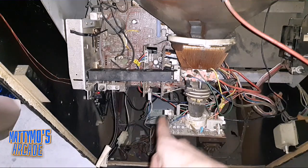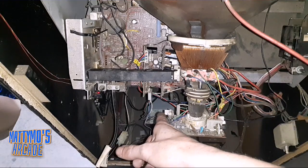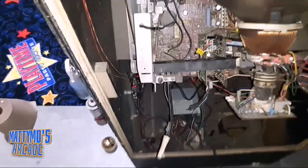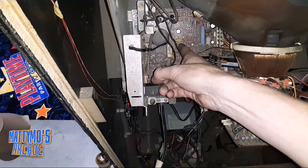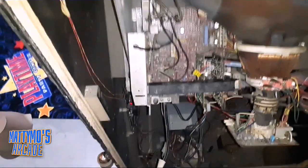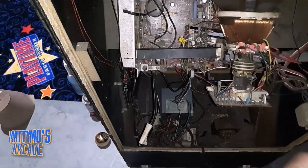And the color transistors are right here. And these are your color adjustment pots here. And then those two are your red and your blue drive. And the other thing is if you're trying to adjust the monitor, we have these little plugs right here. There's four little spots where you can jump her over, and then there's also a red one down here. The red will go side to side, the yellow goes up and down. So I was able to kind of dial the picture in there.